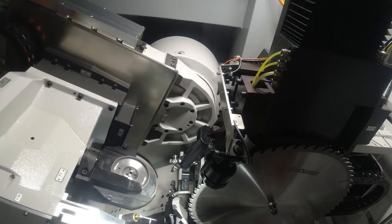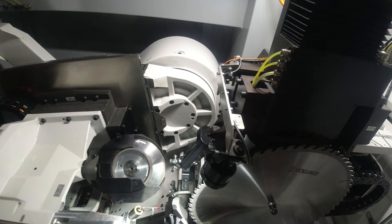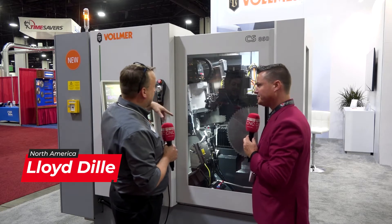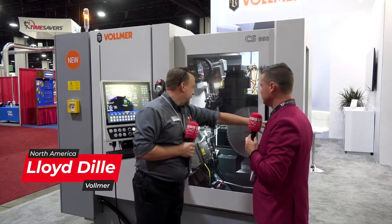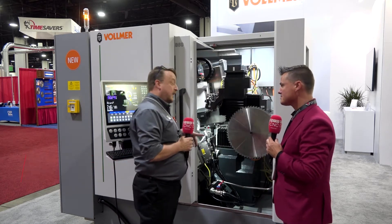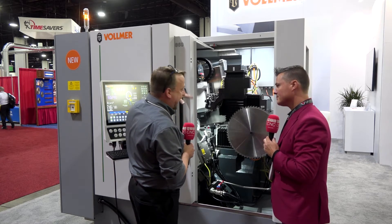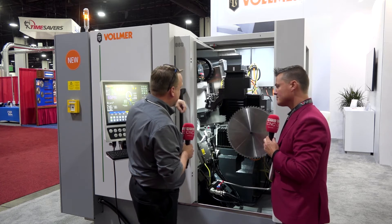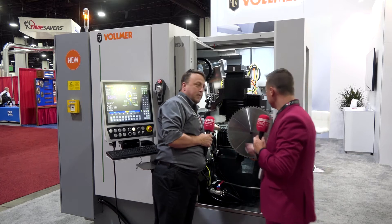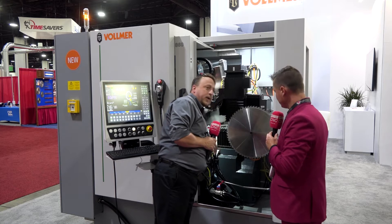Would you mind talking a little bit about what you guys have done to continue to stay ahead of the game when it comes to grinding and these giant wheels? So basically, the new CS860 — if you look inside, it looks very similar to the CHD270, and that's what they wanted to keep. Most everything looks identical, castings and all that stuff, but what they've done is they've added three measuring systems onto the machine now: a measure cube system, a probing system for your angles, and also the microphone pickup.